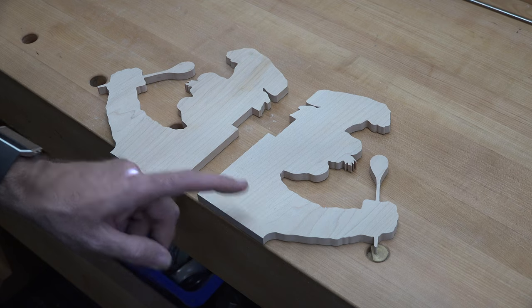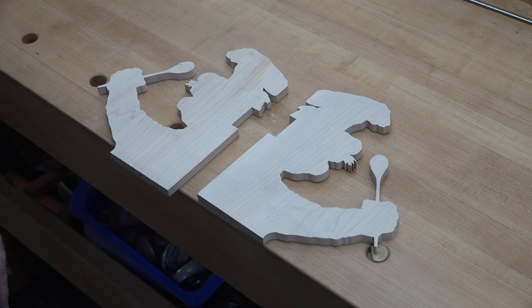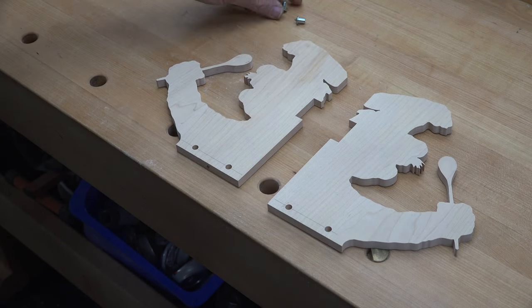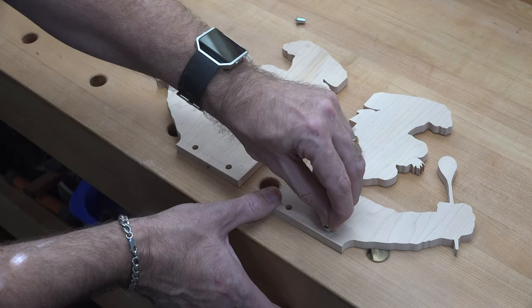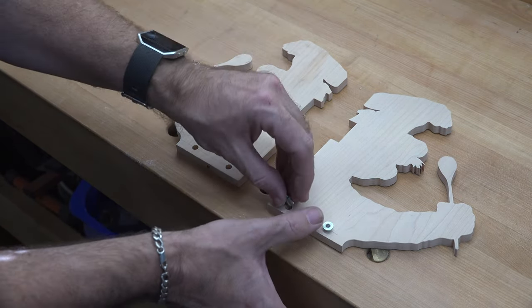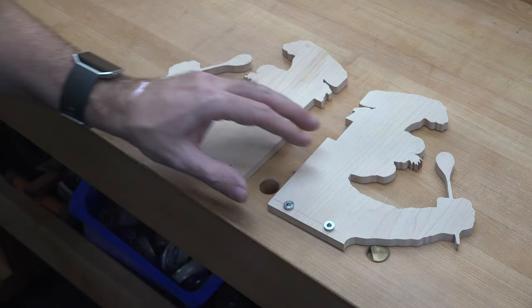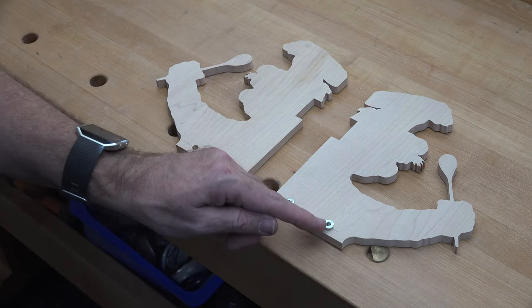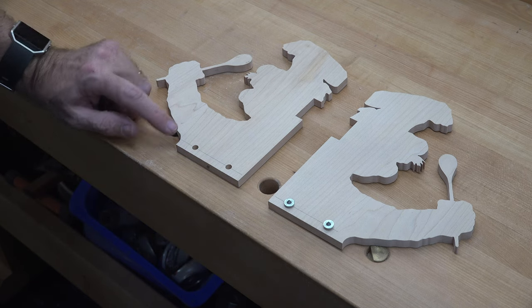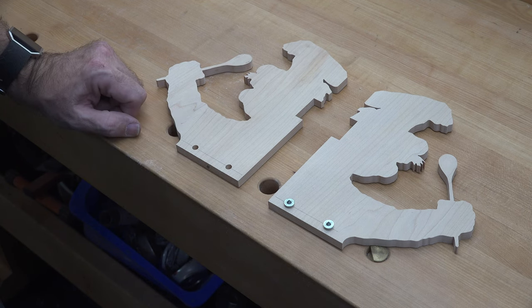And once you get those two holes drilled, then we're going to mark them onto our main shelf. And there we have our holes drilled. We're just going to use a couple dowel centers, and we're going to place those in those holes that we just drilled and line up each one of the sides with the bottom shelf and the back edge. Give them a little tap, and that will transfer our marks, and then we can drill the ends of our shelf, and we can glue and dowel pin our shelves to the end of our shelf.